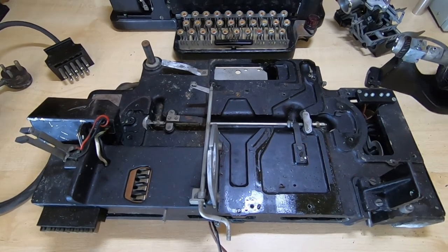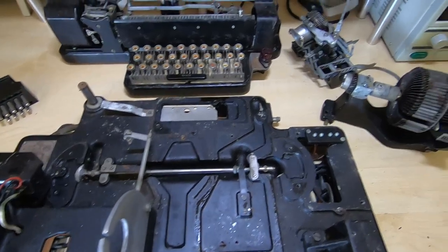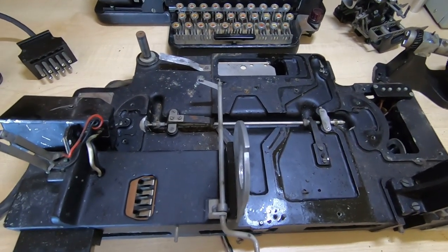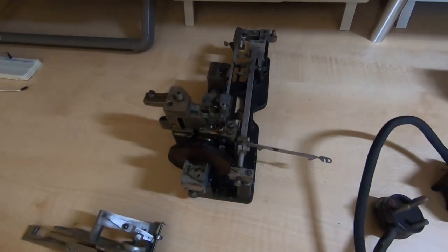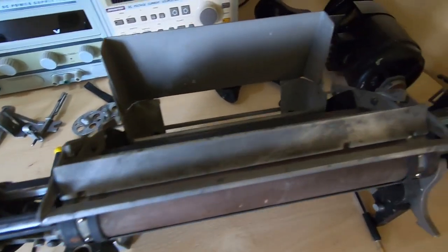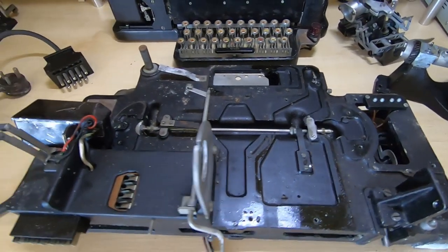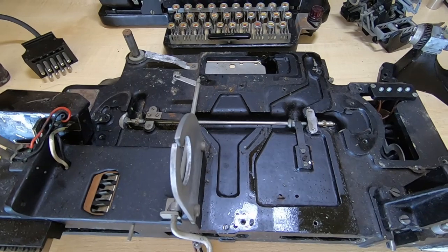I completed that part of the disassembly off camera — it got a bit complicated and I had to take the major castings off the base, so I'll just have to realign it when reassembling. What I have now is the base with quite a few parts still on it including the electrical wiring underneath, which I'll look at in the next video. Then we have the cross shaft, the main indexer and cams, keyboard, punch head, print select head, various bits and pieces, carriage, motor, solenoid, and the ribbon supports and various bolts and screws. In the next video I'll look at working on the base — finish stripping it down, clean it up, and start reassembling that part of the machine.